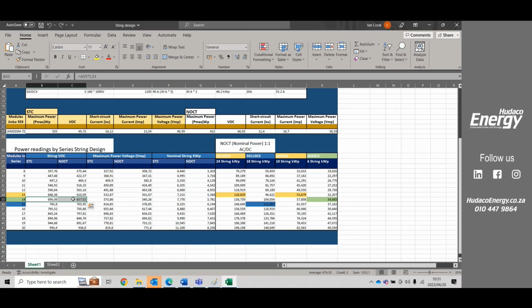So in the event that we get an overvoltage, or we get those perfect conditions where the module is super cold, the cabling is super cold, there's almost no resistance, and the sun comes up intense, we're not going to burn out anything on the inverter. Does that explain a little bit more, Dean?